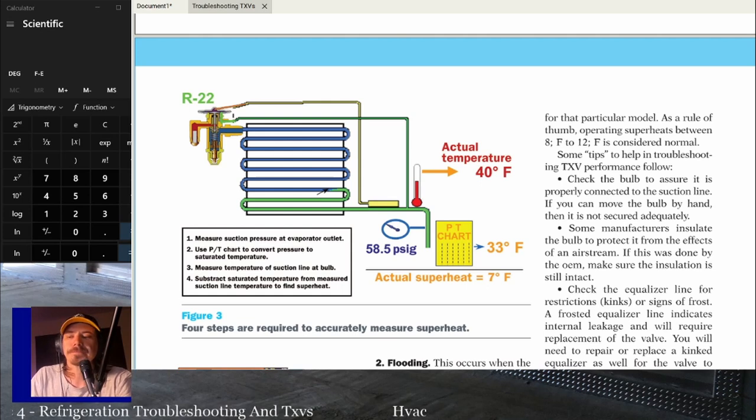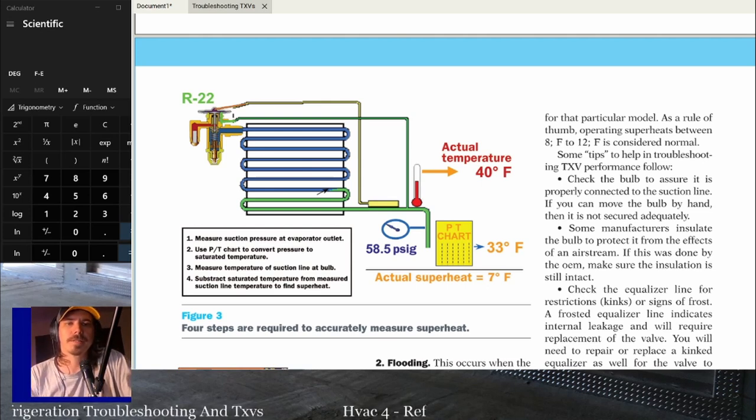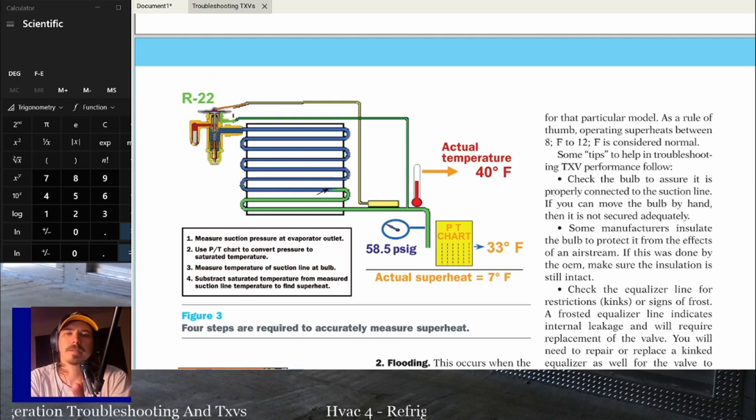The other thing is, if you've got an issue where your evaporator is getting a lot of oil in it because you don't have properly sized lines or you don't have very good oil return, your evaporator is below your condenser, there's not proper oil traps in the system where they need to be on the refrigerant line. If you're dealing with issues like that, then when you get oil inside that evaporator, if the bulb is placed on the underside of the suction line, that's going to affect your reading too, because it'll basically be reading that temperature through the oil, so it's not getting good contact with the refrigerant, which is why generally you're at 10 or 2. You know what I mean? The bulb should be, you know, 45 degrees one way or the other, not on the direct top of the line, but nowhere along the bottom half.